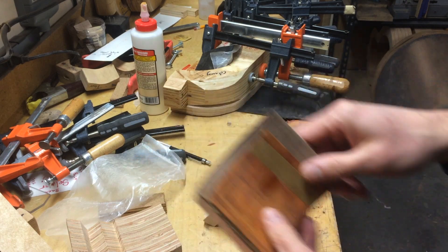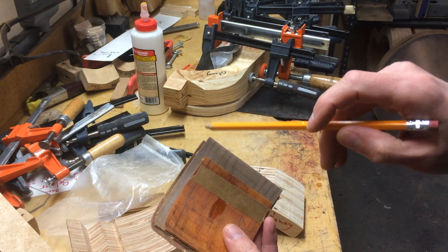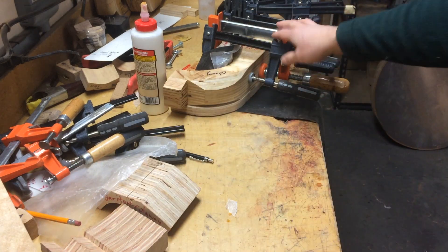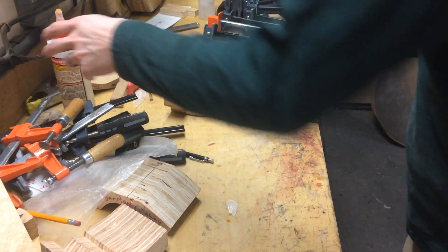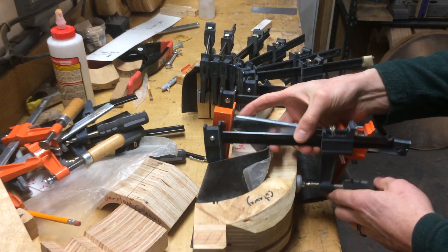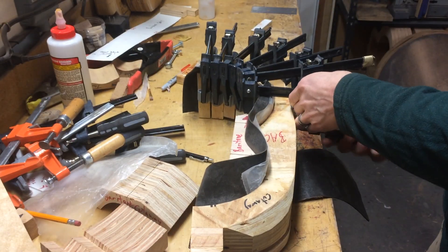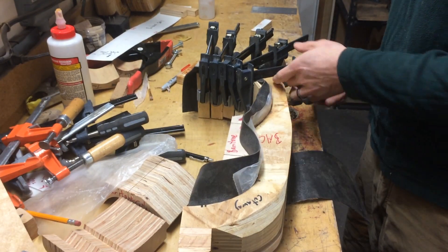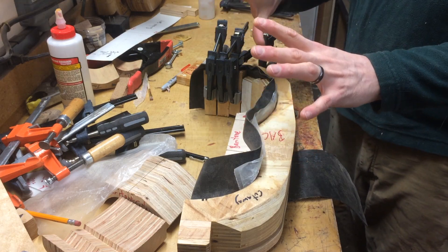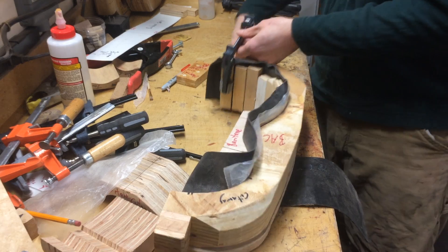Each layer just gets bigger. The outer layer is cut to the exact length, so I will just cut that there and there. Super stiff. This is the cutaway side, which I also used Titebond Red Cap on. Between laminating the bass side and the treble side - this being the treble side - and by treble side I mean when you're looking at the instrument from the front. This is the cutaway side, which is on the treble side.